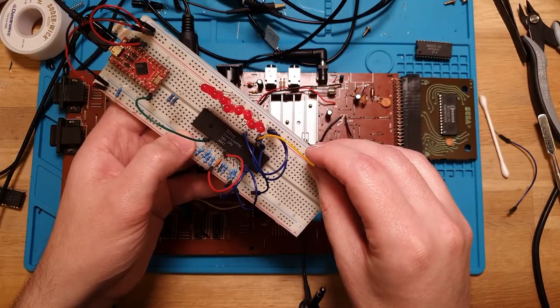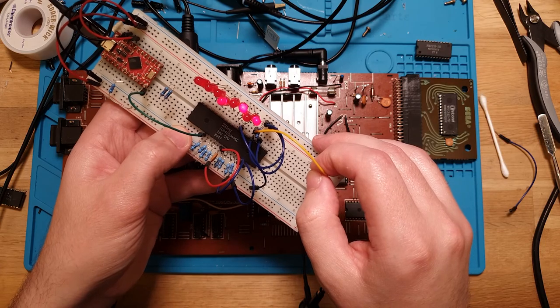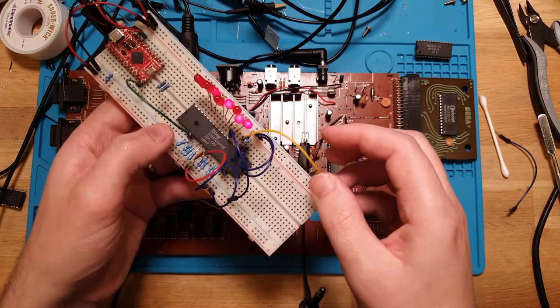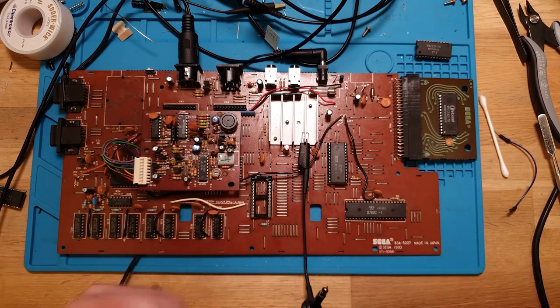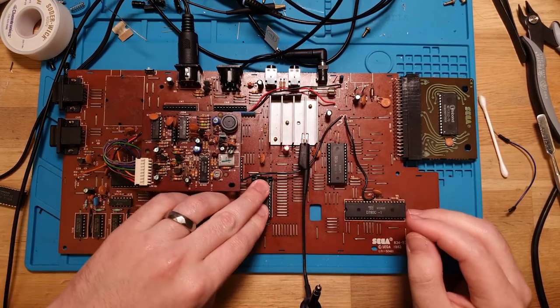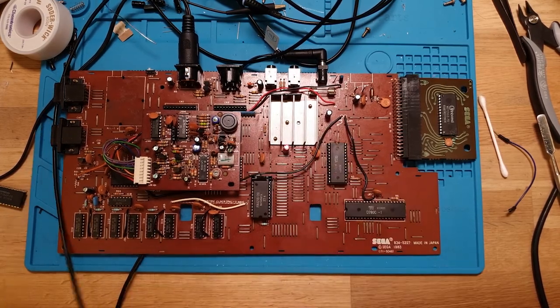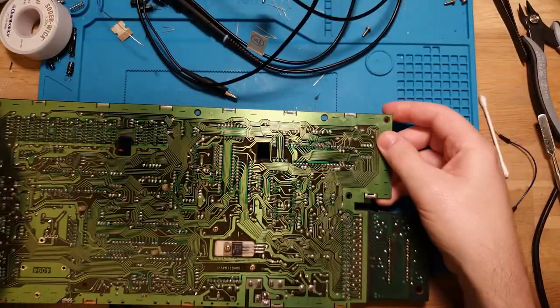As soon as I pull the chip out of reset, the clock starts kicking up and it just counts in binary. And this is just the address lines going one over the other doing a no-op. So I put this together because I needed to test one of the Z80s that I salvaged, and it looks like now I might want to test another one. So let's do the same thing. I'll yank that bad boy out. Let's actually put the original RAM back in here in this oversized socket. Pull that out and see if that's faulty also. I hope it's not, but like I said, I've got a replacement. Let's get to it.